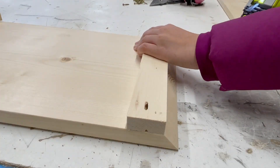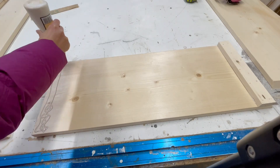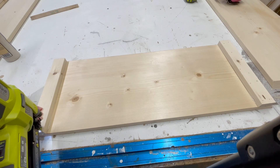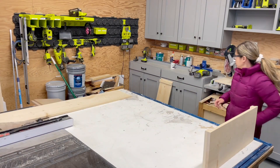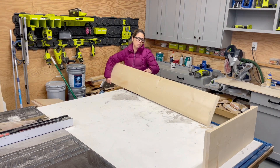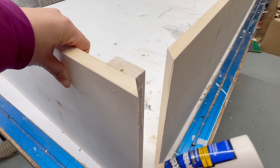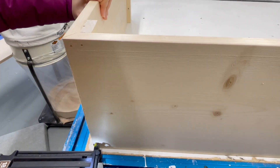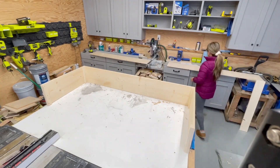We're going to nail this project together. With the face frames on the front and the back, the nails are plenty to secure it. I'm going to start with the two side panels. On the inside I'm going to add some 1x2 blocking to help with attaching the mitered corner together. The mitered corner on the 1x12s was a lot of extra work but it gives it that thick chunky wood look without having an exposed end grain.